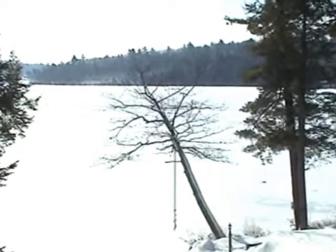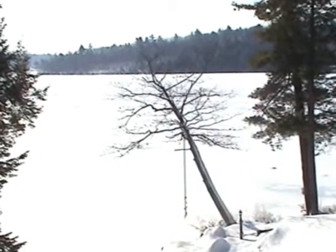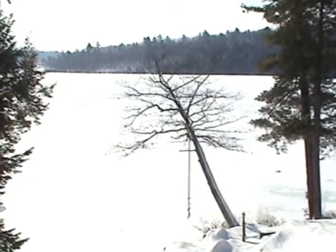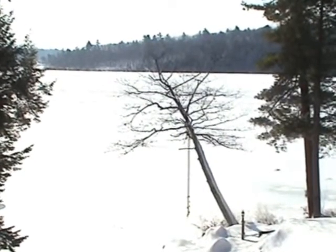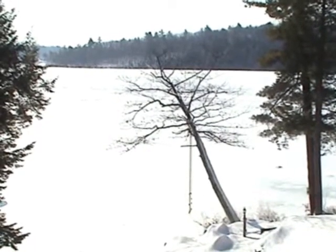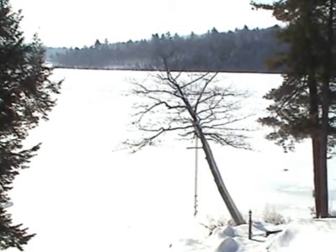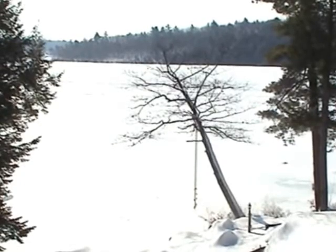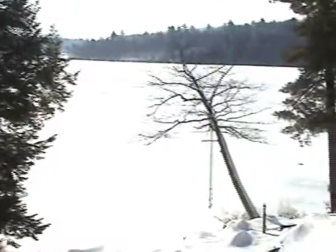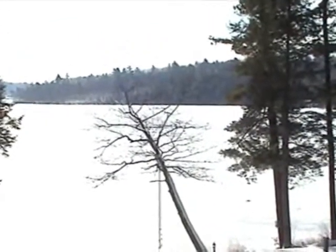Here's our finishing view down towards Lake Winnipesaukee where this new house is being built. So what have we learned today about SIPs? People really like SIPs because you have a wall that's the same dimension as a traditional frame wall — they come in two-by-four or two-by-six increments. You end up with a wall with almost no thermal breaks, which prevents energy loss, and a wall that's very highly insulated compared to almost any other wall system. It really is an excellent package for somebody looking for a very energy-efficient home.